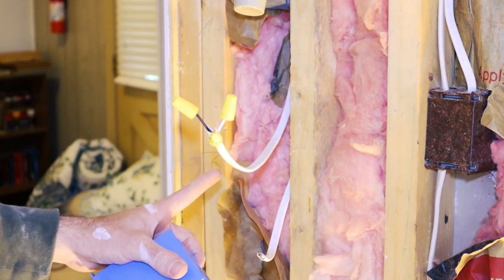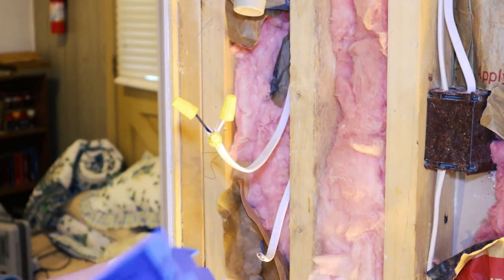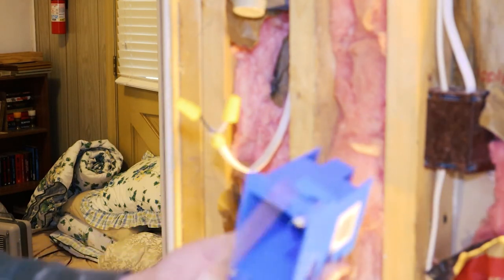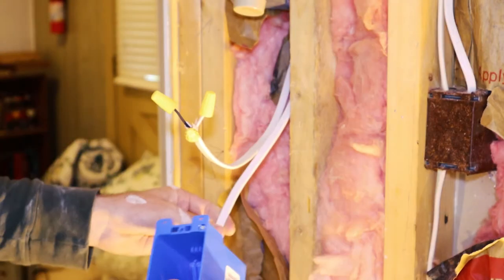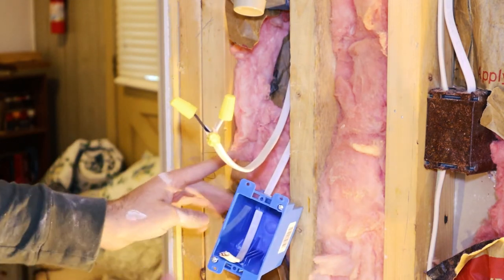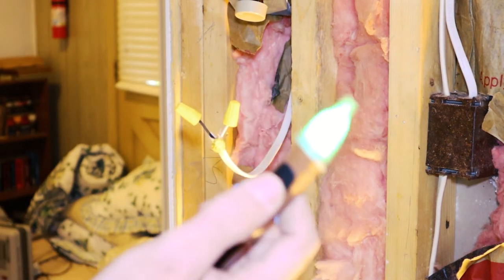Here's my hot — my power. This one is still on right now; I haven't turned it off at the breaker box yet. Remember to always turn your power off at the breaker box when you're actually working on it. Here is an old-work junction box — a light switch box — that I'm going to install once I get the sheetrock up. I'm not going to officially install it yet, but I'll run the wire through it. You just punch these knockouts out. I need two because I have two wires coming from the top. Everything is off — test it with a little electric voltage tester.